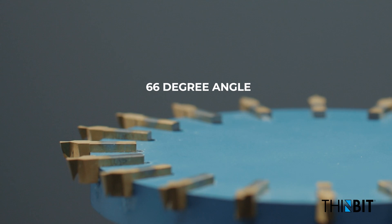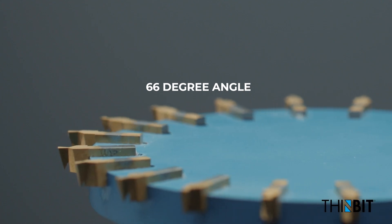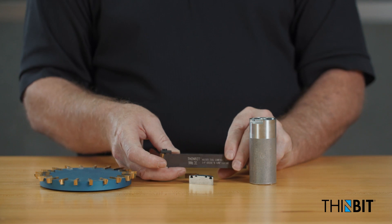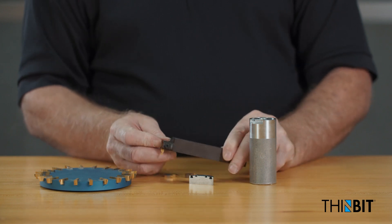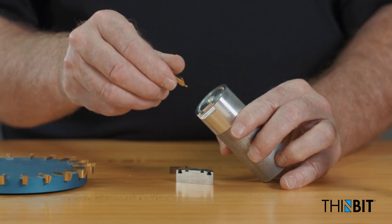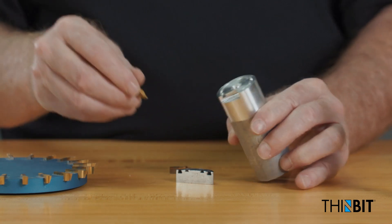Inserts are designed to form a 66-degree angle to the bottom of the groove. An OD and ID insert pair is required to form a full dovetail profile to maintain insert strength and prevent breakage. The center of the groove should be cut first, and then each side of the groove should be cut using a two-axis move to follow the 66-degree angle and profile the face radii.